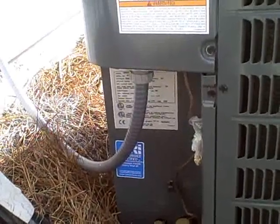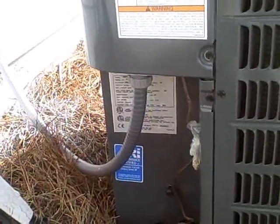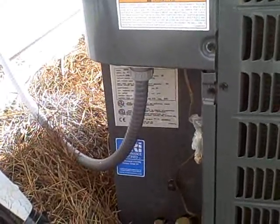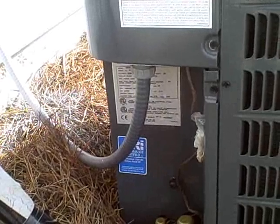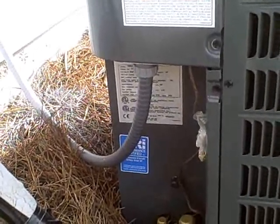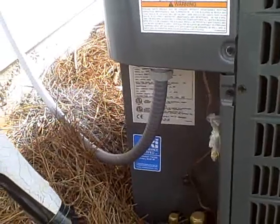It's going to tell you how many amps the unit draws, which is going to tell us the minimum wire gauge required to connect it. Also, it's going to give us the maximum acceptable circuit breaker that you want to connect to it so that you don't overheat the wiring or have a problem.